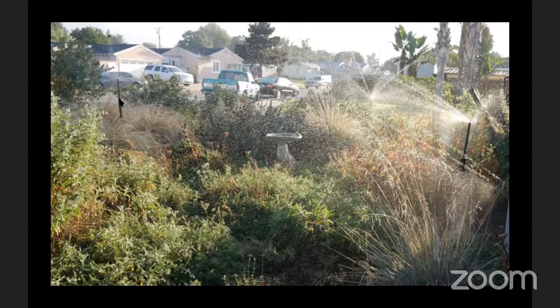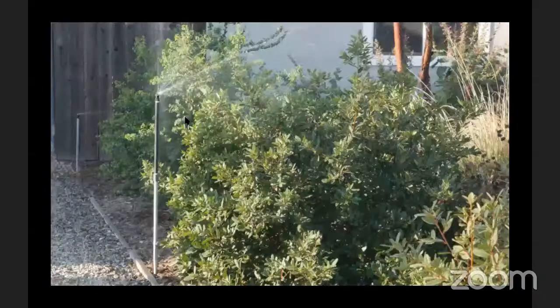And then when the sprinkler pops up, it goes another 12 inches to really go above the landscape, but then it goes back down. And all of that is just on top of the riser above the soil. And in another area to get over this shrub growing in, you can see here's how it was originally. And then here's, I just added another, I think 1 foot or 18 inch riser, and then put the shrub head adapter back on. So that was last year.